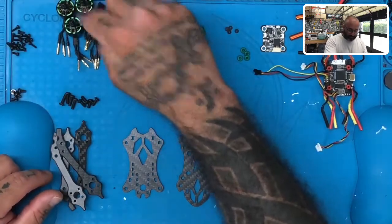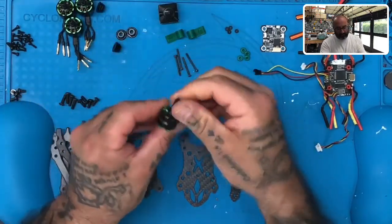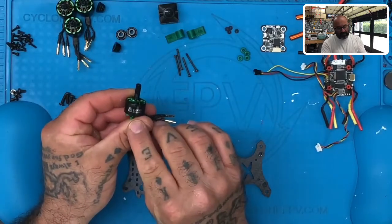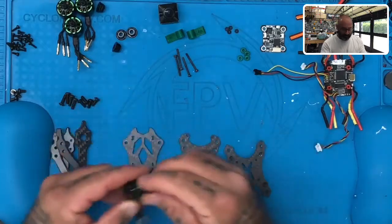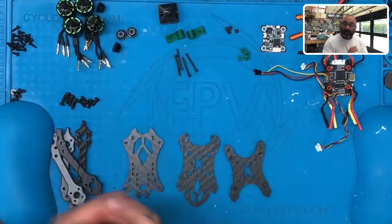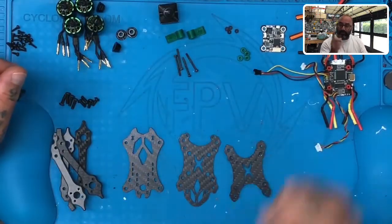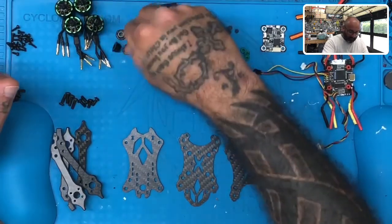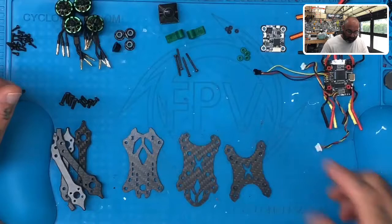You have your motors right here. These are labeled for us, but they're made by Flash Hobby — these are the 1408-2800KV motors. That means for every one volt you give this motor, it'll spin 2,800 revolutions per minute. We also have the locks here — the fasteners that will hold the propellers down when they're on.